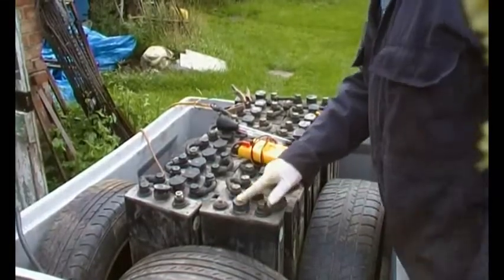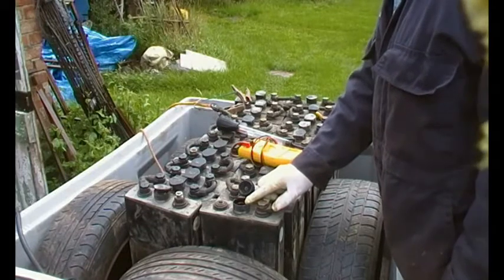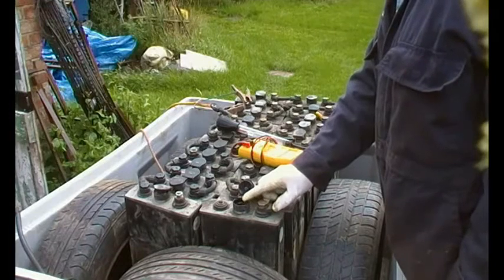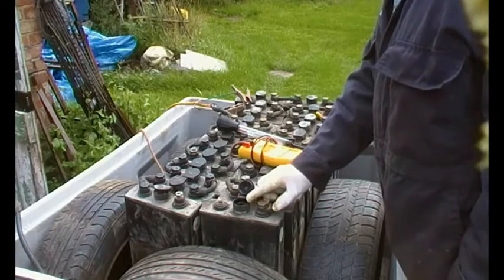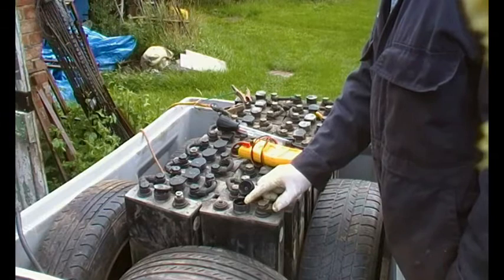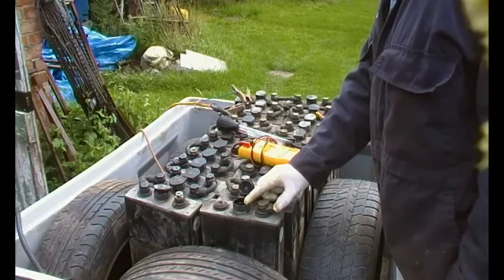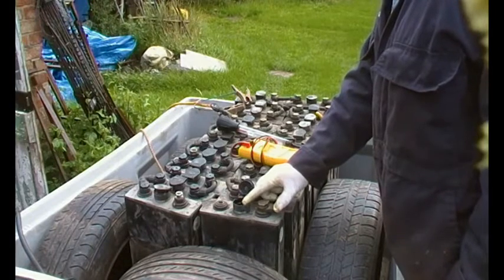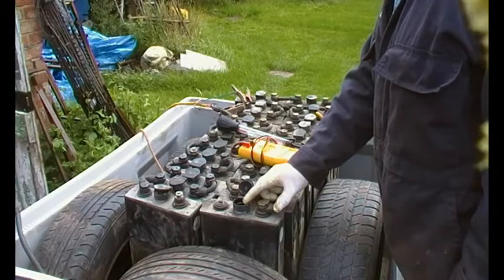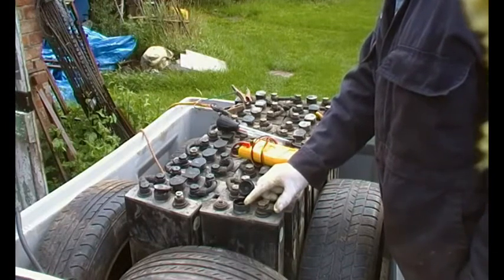Initially when I opened one of the caps I could see no electrolyte, just the plates - that's normal for a fairly discharged cell. The good thing was I didn't have to put very much in - maybe 100 mls - before the electrolyte level came to just at the top of the plates. Don't fill it right up, because as you charge, the electrolyte expands as the SO4 part of the sulfuric acid moves from the plates into the water, making the mixture bigger.